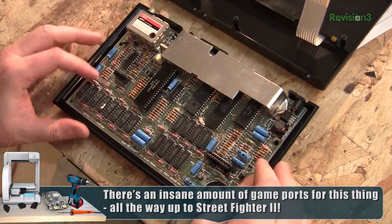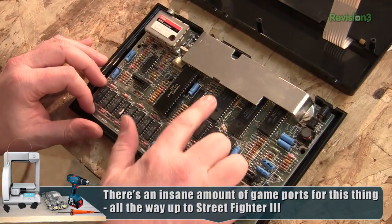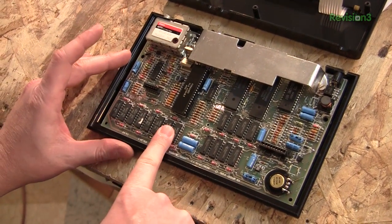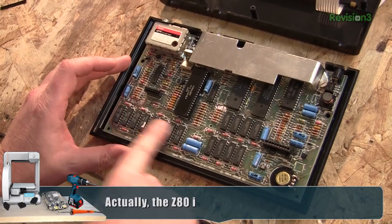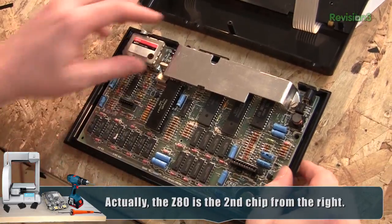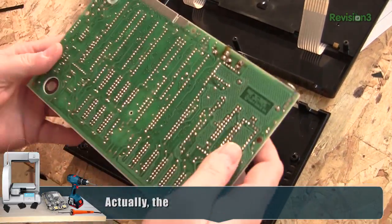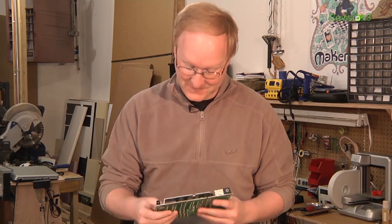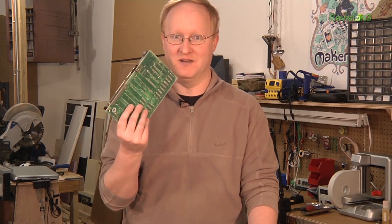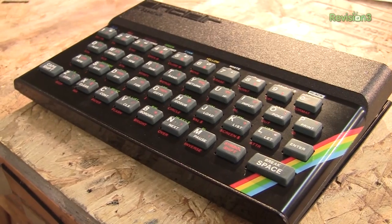This is a far cry from my Atari 800 — there's not much to it. I'm sure one of these is a display processor; this is probably the Z80. Here's the famous defective RAM — they put in defective 64k chips so they could get a working 32k, just anything to save a buck. It only has silkscreen on one side even. Look at this insane heatsink coming off the 7805. If you have any cool ideas of what I could do with a Timex Sinclair Spectrum, send them into the show. My default idea is to make it into a portable Timex Sinclair Spectrum laptop, of course — and it's so cute.